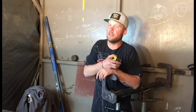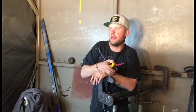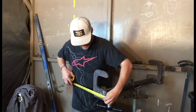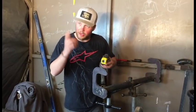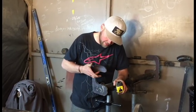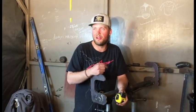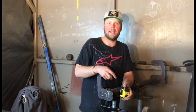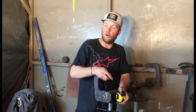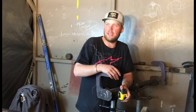The thing is you need to build this thing stout enough that it can take all sorts of pressure. It's going to hold your piece straight so that when you finally get done and it's cooled down, it's going to keep it from wanting to banana up and ruin it. Now, another thing — if any of you guys don't know this, a round cut is stronger than a square cut. I'm not an engineer, but I've seen a lot of square cuts rip out and a round cut will take a lot more pressure. Anybody that knows why, leave it in the comments — I just know that's what I've been told. I learned it from the old timers.